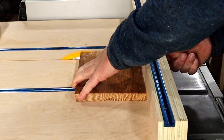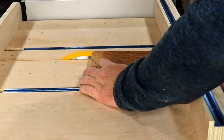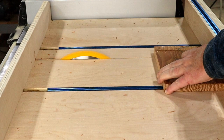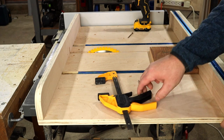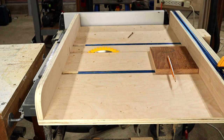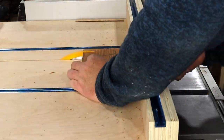It's time for the 5-cut method. The basics: take a scrap of wood, cut it once, then rotate it so your freshly cut side is against your fence. Do that three more times until you're back where you started, then cut off about an inch or so. You can now measure each end of that piece to determine if your fence is square. There is some math involved — I'll add a link in the description for a calculator that'll help. My first attempt was off by quite a bit, so I pulled the screw out of one side of the fence, made my adjustment, and drilled a new hole to reattach the fence. Then did the five cuts again. This time my measurement was right on — or at least close enough for me.